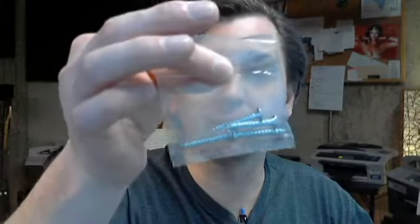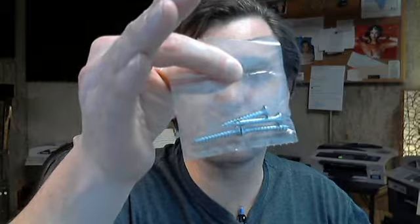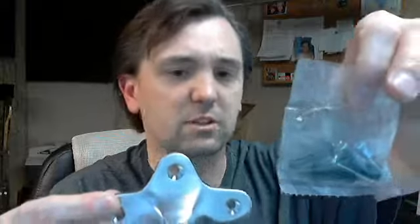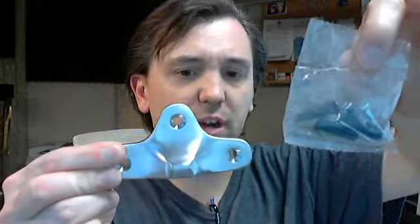Screws are included — these are the four screws. They look like number ten by inch-and-a-quarter flat head screws for the housing. The floor strike includes number twelve screws, possibly larger, and plastic anchors.